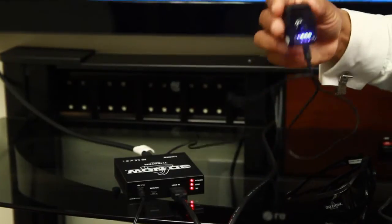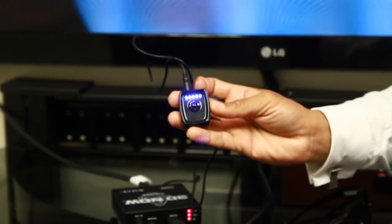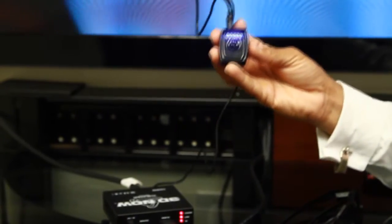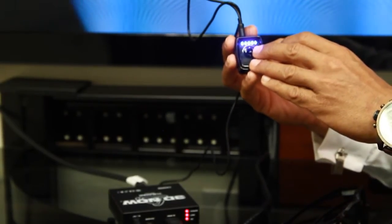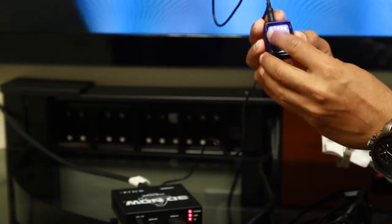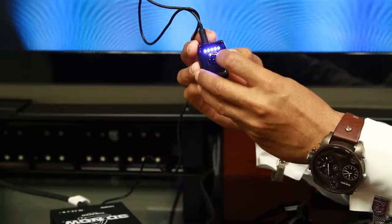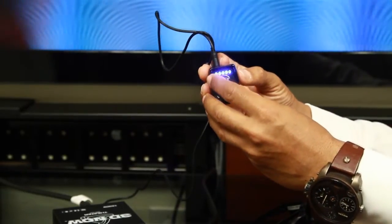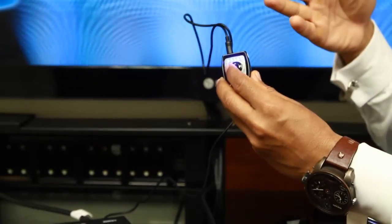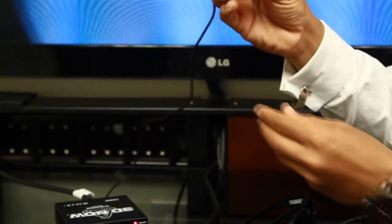As I plug it in, my emitter comes to life. I've got blue indicating LEDs telling me that it's functioning. When I do get stationary blue LEDs such as what you're seeing right now, that means my emitter is working. Before these LEDs come in, you might see red flashing LEDs. If you have gone through different modules, you will know that we've spoken about those flashing LEDs. That will only happen while it is tracing the 3D signal and trying to sync to it, or when there is no 3D signal available. It automatically went to blue because we have a 3D signal playing, so our setup has been methodically done — we put an image on the screen, plugged in the emitter, and right away we've got a 3D signal.